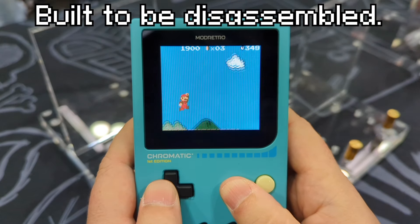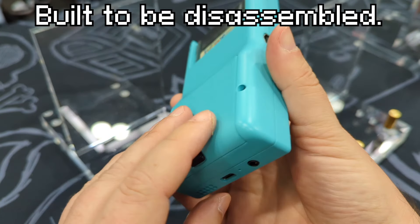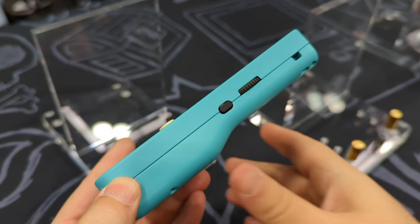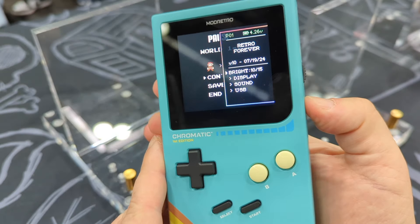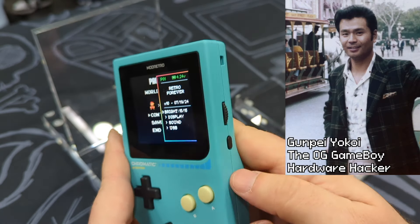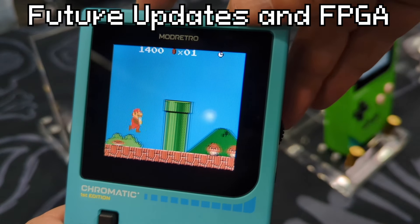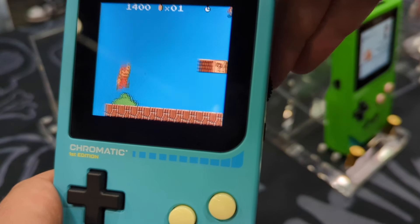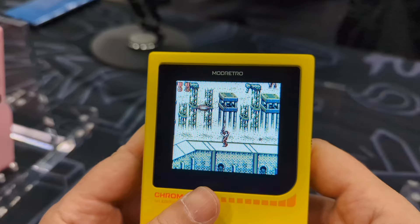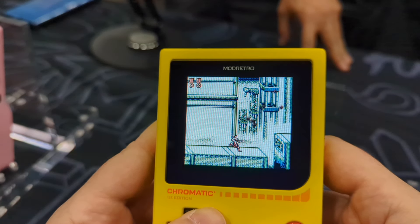The developers said they started from an open source and open hardware perspective. The unit is put together with tri-wing screws, which are common in Game Boy-type systems, and nothing is glued together or held with clips. They were well aware of the Game Boy modding scene and hoped there would be customizable parts in the future. I told them Gunpei Yokoi would be proud. The FPGA system is robust enough to hypothetically handle additional cores for other systems if independent developers want to put them together, though the company itself wasn't going to be supporting anything beyond Game Boy Color and Game Boy.